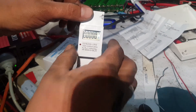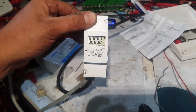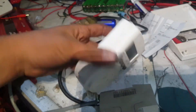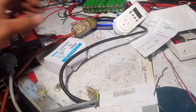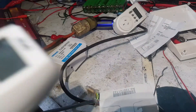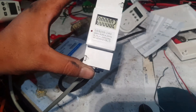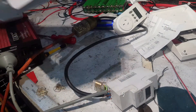This thing's awesome - it was like 16 to 18 bucks, under 20. Links in the video description. This will be great for Bitcoin mining guys - put this in line to the power brick and you'll know how much power your rig's used, forever. You don't need those little plug-in kilowatt hour meters - they're 20 to 30 dollars each, mine's dead, I've got another one that's dead, the batteries go flat and they forget. These Arlec ones are a bit better but it's just extra loose contacts. If you want to use serious mining rigs this can take 63 amps at 240 volts. I highly recommend this. Just clicked over 0.2 - got that on camera. That's going to get installed into my switchboard for my inverter outlet. Link's in the top of the description.